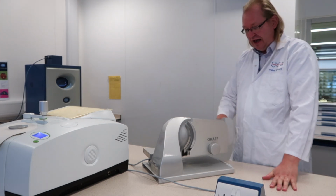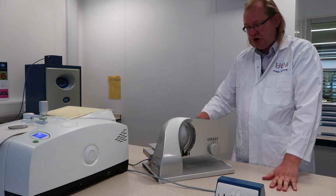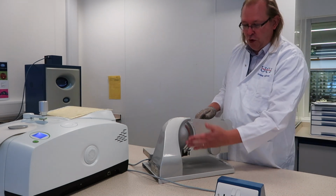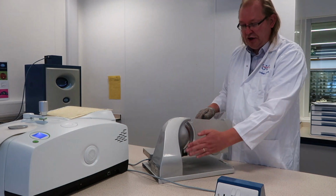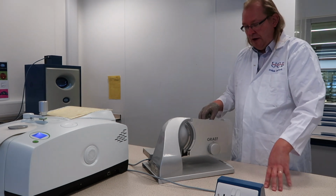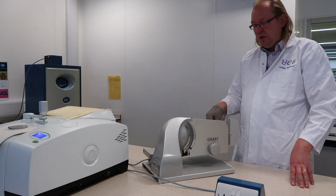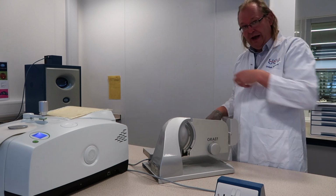So hand on the side, and then as you put the product in, you simply push the product nice and slowly towards the blade. The slice will fall off this side. You can take that off with your hand. You are safe on this side with your open hand. Then you can bring the product back and take it out with your gloved hand. Don't go in that way.